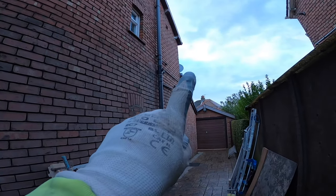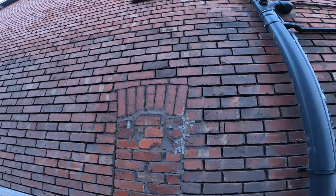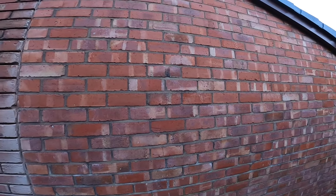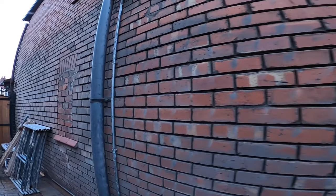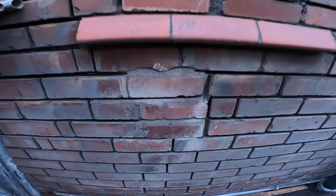But for today, I'm going around the back, doing the back section there, across that extension. And this is Alex's little project for today. He's going to take the arch out, all the brickwork out, tooth it, and then rebuild it. We can't get a perfect match on the bricks, but we can get them. So they're close-ish. Obviously not going to get a perfect match on them, but they'll look better than that when it's done. And then the couplings come out of there.